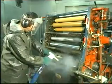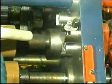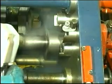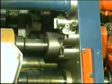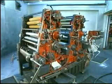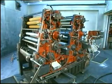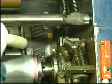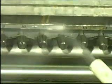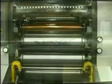Because the dry ice converts to a harmless gas as soon as the cleaning cycle is complete, there is also no harmful media left over that can rebound from the work area and damage neighboring equipment or personnel. This is particularly important when refurbishing large machines where the work area is surrounded by sensitive electrical or pneumatic equipment which would need to be removed for abrasive, chemical, and aqueous or solvent-based processes. Dry ice cleaning of a large printing press takes a few days; conventional cleaning takes many weeks of skilled engineers' time.